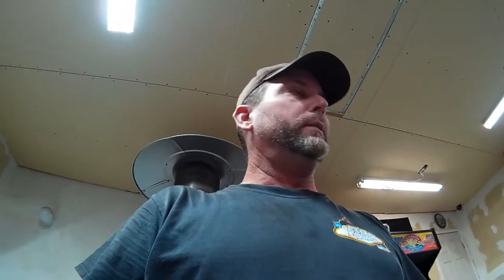Got a lot of work done today. Unfortunately, my battery went dead, probably while on the drill press video, so I didn't get a whole lot of the frame prep. I had to straighten out the frame quite a bit. It had a lot of dips and high spots in it. So I straightened out the top sections of frame rail and bottom sections of frame rail and tacked them in. I then ground down and fitted the reinforcement plates that are going to box in the inside of the frame and got them all tacked in. So I got both frame plates tacked in position, good to go.